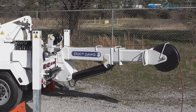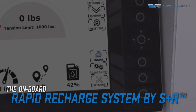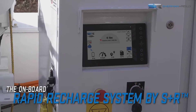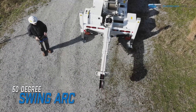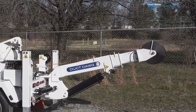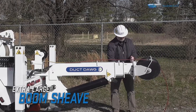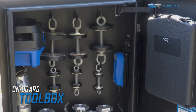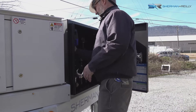The Duct Dog E Plus is designed for all-day electric use, and with the onboard rapid recharge system by Sherman & Reilly, it's ready for any challenging conditions or multi-day pulls, with no need to plug in the unit for recharging to complete a job. Its fully articulating, self-supported, three-axis boom can be fully operated by the remote control, and is equipped with an extra-large 17-inch sheave with swiveling head. A custom onboard toolbox secures, organizes and protects the remote control, air adapters and dies while providing extra room for sheaves or other tools.